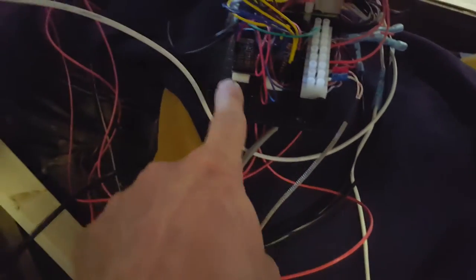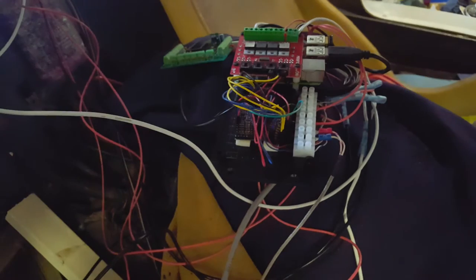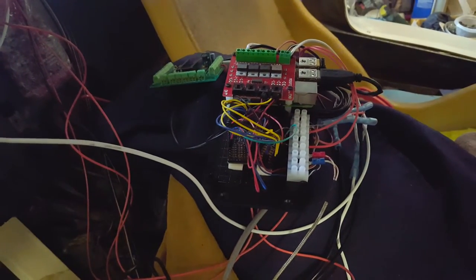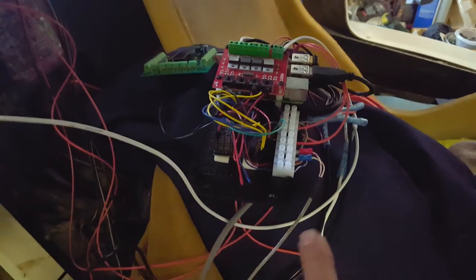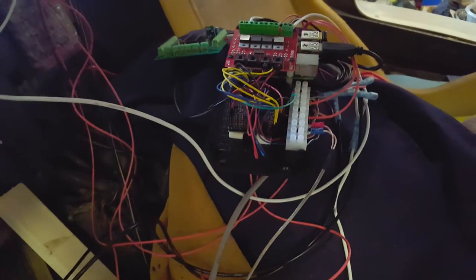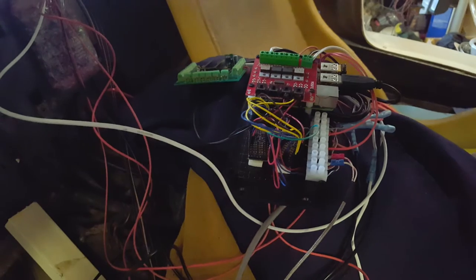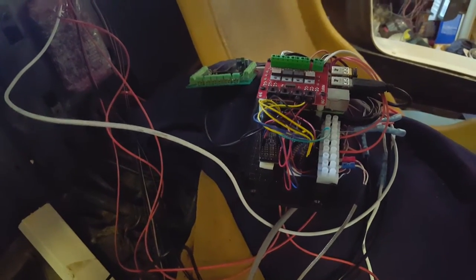One Teensy — this is all one big project box — is running the fuel injector: controlling how many times a second and how wide a spray per spray time. The other one is running the fumes, which we're calling 'running of the fumes.' It monitors the temperature of the fumes box and opens the EGR valve to introduce some heat into the box.